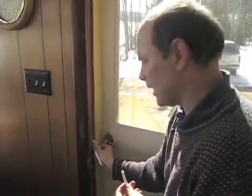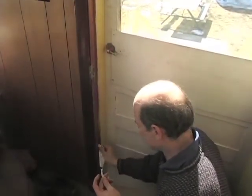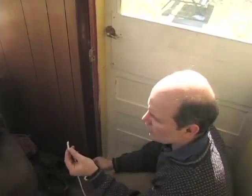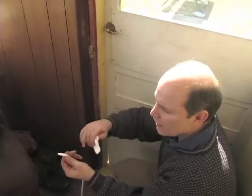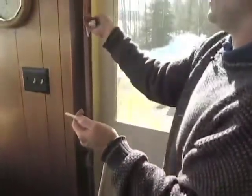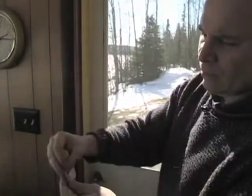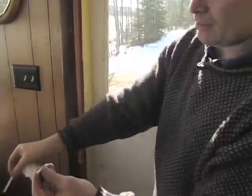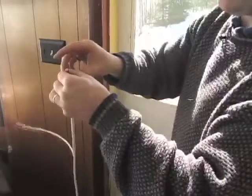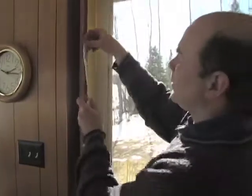Let me mention also while I clean this that though the adhesive is fairly sticky and it's a fairly strong tape, to make this last, I would obviously go ahead and try different types of maybe glues. And every 3 inches or so on the back of the gasket material, put a dot of glue. Now, I'm simply going to go ahead and fold this back. And as I go, I'm going to go ahead and unfurl the protective layer.